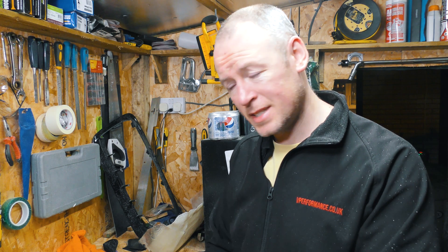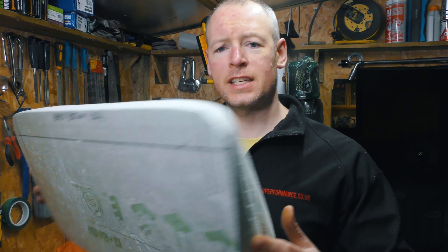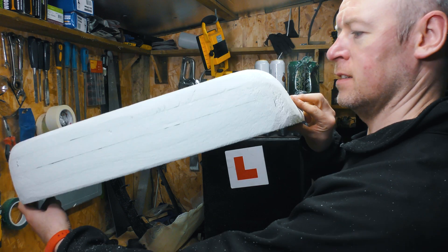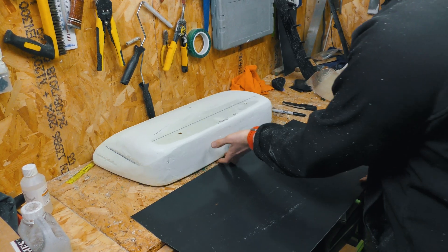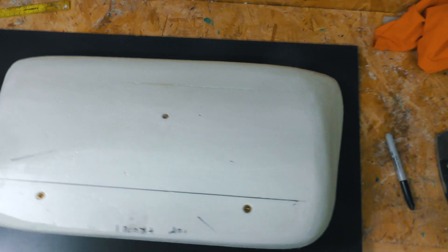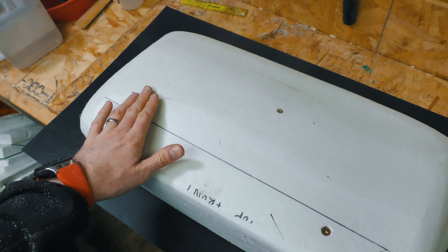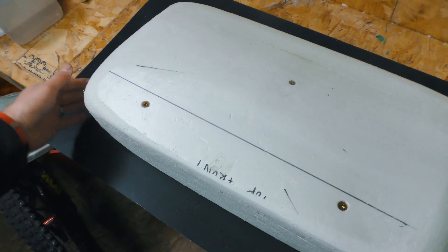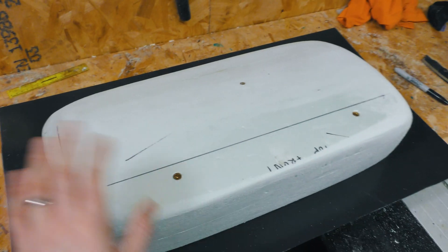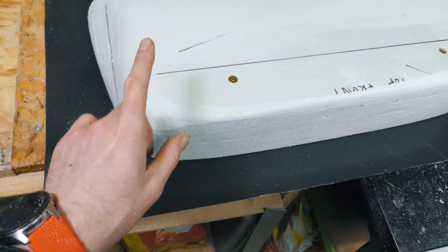I made a fair amount of dust. Plan B has kind of become plan A. That is a three-dimensional, sanded, smoothed, correctly-sized hood scoop basically. The hood scoop goes on there and with a gap all round it I turn this into an epoxy-surfaced version of itself, then sand it all smooth, and that allows me to mould as many as I like from this three-dimensional plug.